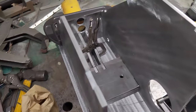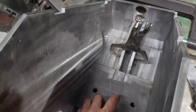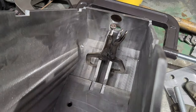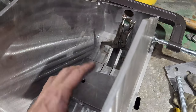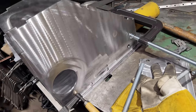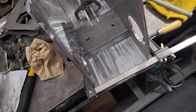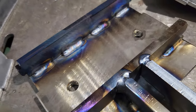Here is the rear hydraulic box. As you can see, it is self-jigging — all the little tabs come through here. I'm going to actually tack this part together, take it back apart, weld up the bottom a little bit, put it all back together, and then start welding it up. Two hydraulic rams: one bolts here, one bolts here, comes up, and then that rear torsion part goes right here. I got it all ground down so it's ready to paint. I'm probably going to throw in some weld-through primer before the final to make sure everything gets coated well.